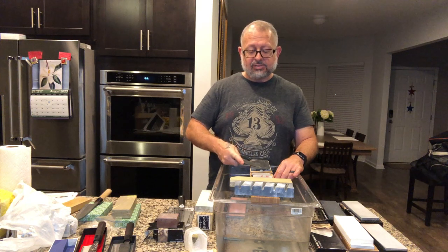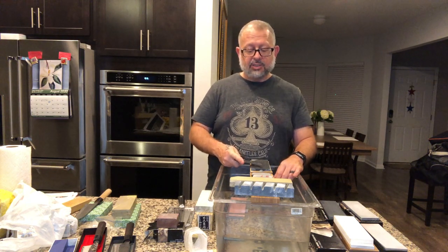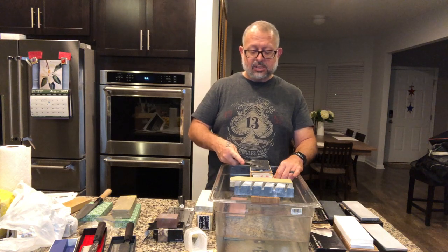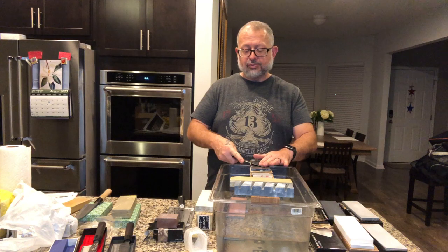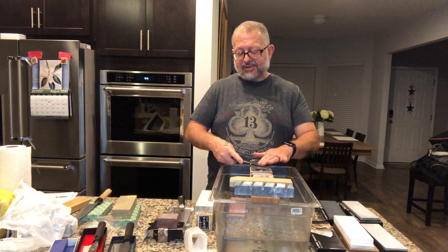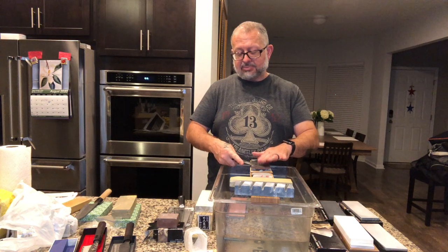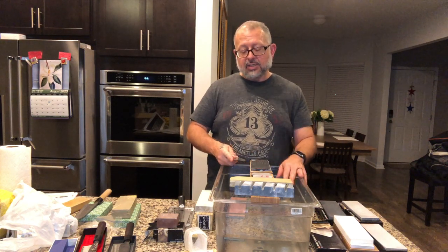When I put this down, if you don't know what your angle is, you'll hear Ricky say that you should move this around until you're moving it back and forth and you feel it. You keep making it flatter until it slips. And if it slips, it's too flat. And when you come up enough that it's catching, then you've got it.